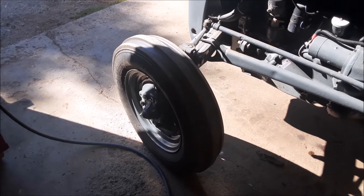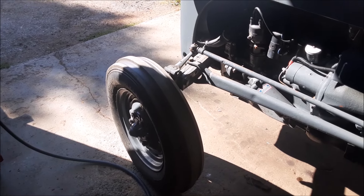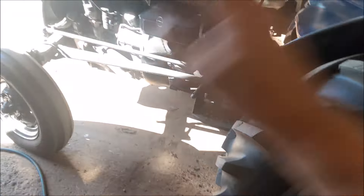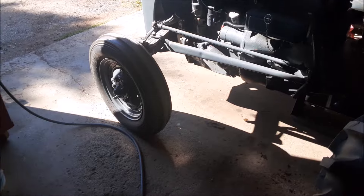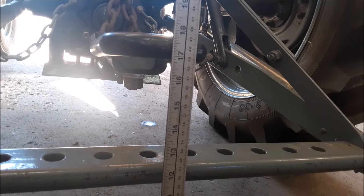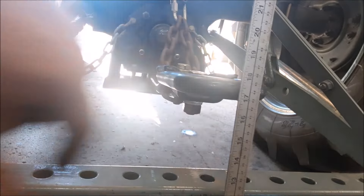The other thing we're going to do is the front tires — we're going to make sure they're blown up hard, hard, hard. The least amount of contact with the ground you can have with the front tires the better, because it's friction and it's drag. You want all the power she's making to drive these back wheels and pull the sled. You don't want the tractor having to fight anything else. I found the front tires had about 20 PSI in them, blew them up to 30. That lifted up the front end, which lowered the back — the rear axle became the fulcrum. So now our drawbar is a quarter inch lower and we're going to adjust it again.